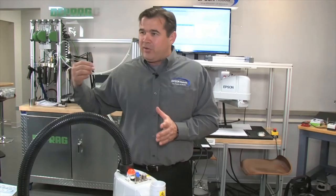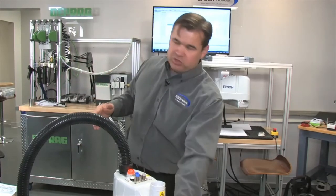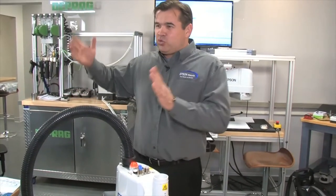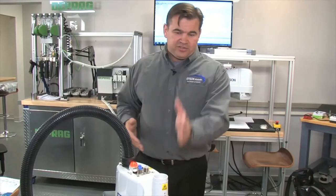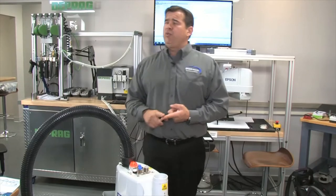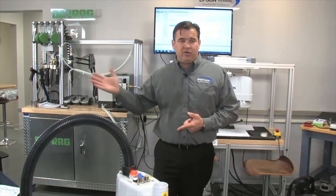So again, think some guys, they have a tool offset and they could be 12 inches offset. It doesn't take a whole lot of force to servo out that motor, even in high power, if I'm at a 12 inch offset on the center line of a small spline. But people forget, you got these engineers that are really smart, they go to school, but they forgot that 12 inches from the center line of something or 6 inches from the center line of something could easily translate into a whole lot of force on the center line of my z-axis. So again, if I got a G3 robot, I'm within payload, I'm at 3 kilograms. Yeah, but if you're at 6 inches offset, 3 kilograms, that's a lot of weight that I got to accommodate.